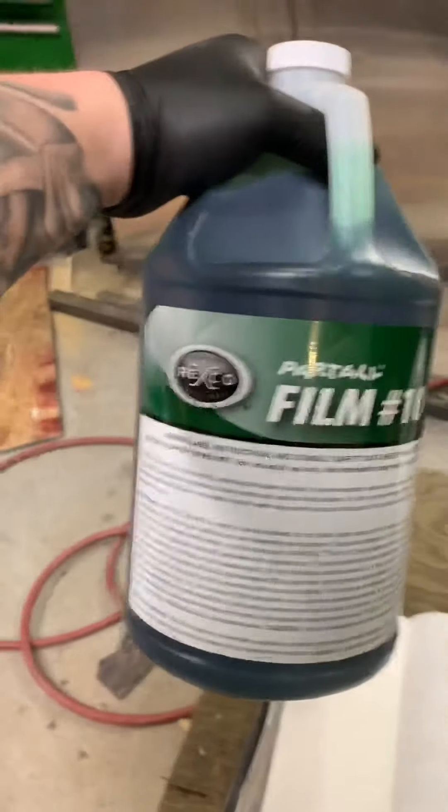The dash is all finished being waxed. I hear two kind of different things — a lot of people say just put on one thick coat because the point of the wax is that when the gel coat resin heats up it'll melt, and that's what creates the physical release. I've also seen people say wax on, wax off three to five times. So I did a bit of both — waxed on, waxed off, then did a thicker layer on there. Now it's time to use the PVA release film.